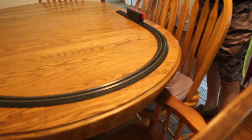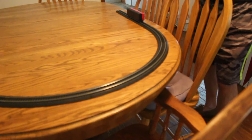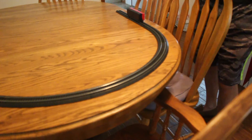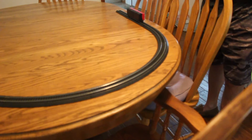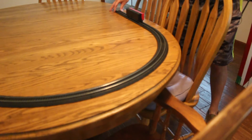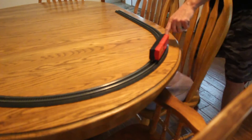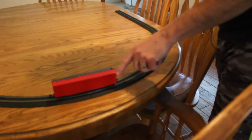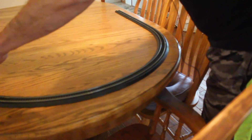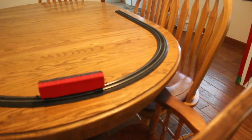You know where your red wires have to go and the black wires have to go. DCC is not a positive/negative thing because the current going through the track is actually AC, not DC — so they describe it as an active rail and an inactive rail. You just use red and black, or whatever colors you're using, as long as you keep it consistent throughout — red on one side, black on the other. With the added weight, I can push this and it doesn't want to fall off the tracks, which is a good thing.